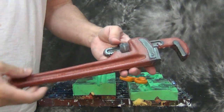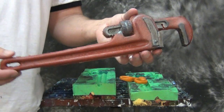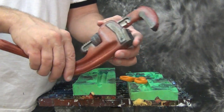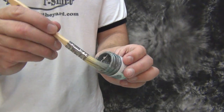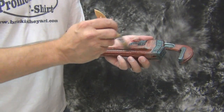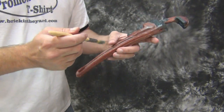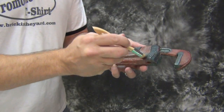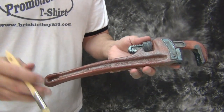Once we've trimmed up our part, we're going to do one last finishing touch to make it look more metallic. Notice the nice intrinsic deep red we got by mixing black and red Poly Color with our foam. We're also going to give it the look of scuffed metal using some silver metal rub — a Sculpte Nouveau product that is essentially a metallic wax that dries and cures and is very difficult to remove. We dry brush some of that over the high points of the piece to give it the look of slightly worn steel, especially on the lettering and any raised areas that would naturally scuff and rub off the paint.